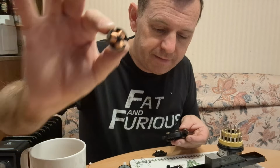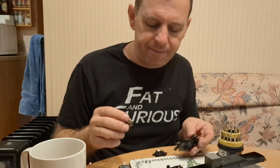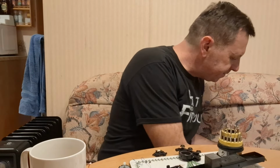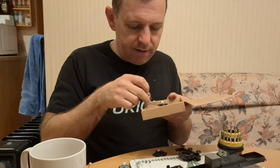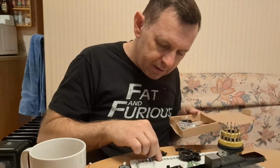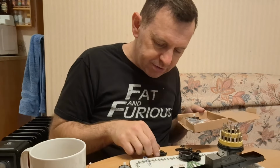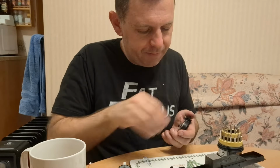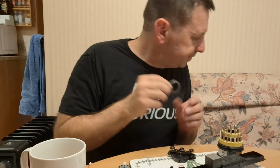This is the ringfield. That's in really good condition. I don't think that's seen a lot of use, if any. So I'm going to put that in my little box of spares. Oh, there's another stay alive there. The brushes were still good. The springs were still good. I'm pretty sure I don't need that backing plate either, so I'll save all of those. Okay. The magnet.